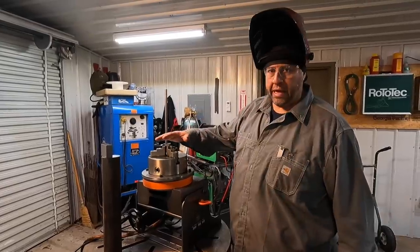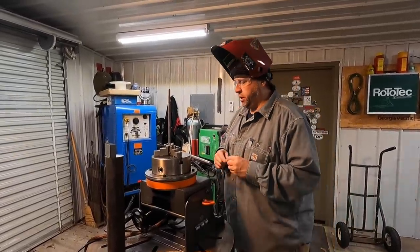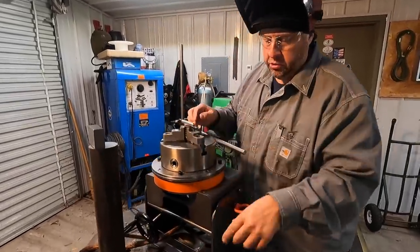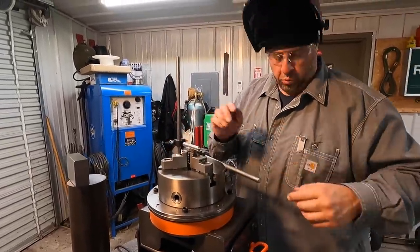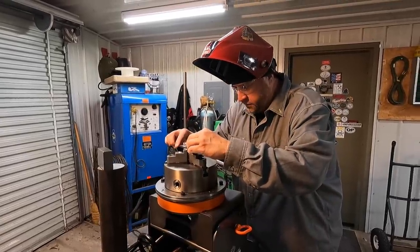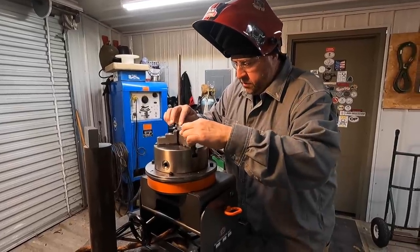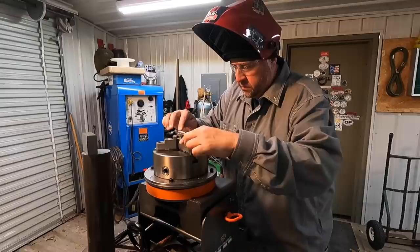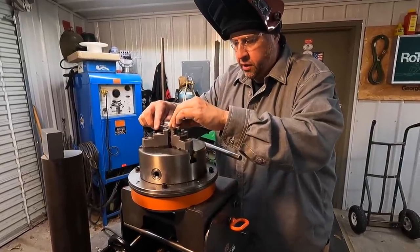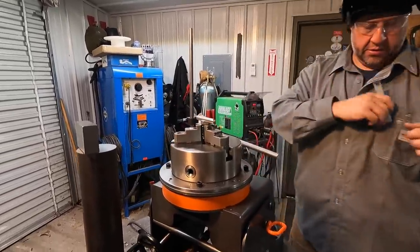All right, so we're set up on the AC welding positioner here. We're gonna get our welding done. Both pieces are very clean. I'm gonna use a hammer just to put some weight on it to hold it, hopefully. We'll get one side tacked, and I'll rotate it around and then weld the other side. So just equally spacing it with a scale here, eyeball it, scaling it to 1.25 inches on both sides. That'll work right there.